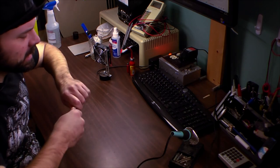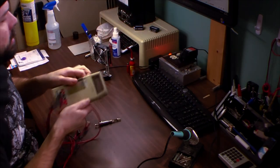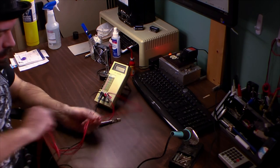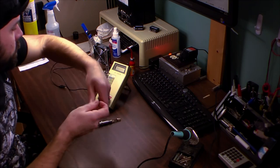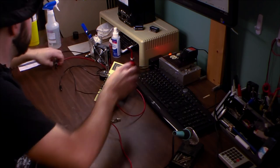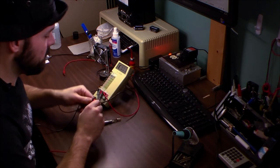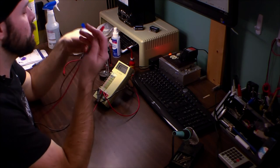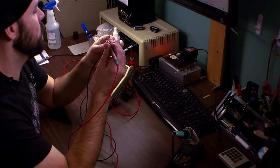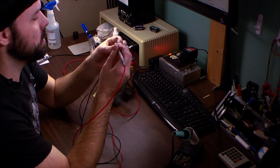That's a tight hole. So we have to get out our multimeter. I can't afford a real Fluke, so I have a vintage Fluke — still works well. Now it's going to need this lead. Some ohm tests. We go there, we see zero, we know it's working. Now let's find the ground prong — it's probably this one. Oh, it's definitely that one. Getting ground off that... and ground off that too.